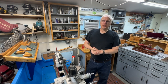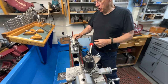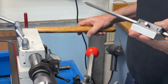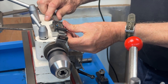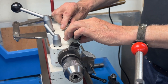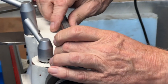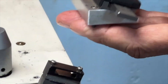After watching this video we realized there was a simple fix to make it easier to install. This binds when it comes right up close to here — but you have six inches of travel on this and the tailstock only has four inches of travel, so you've got two inches extra to play with. The farther you move this back, the less alignment problem you will have. It's when it comes right up to the root that it jams, so I would move it back as far as you can — there's an oil hole here, and if you cut out there you could move it back almost three quarters of an inch.